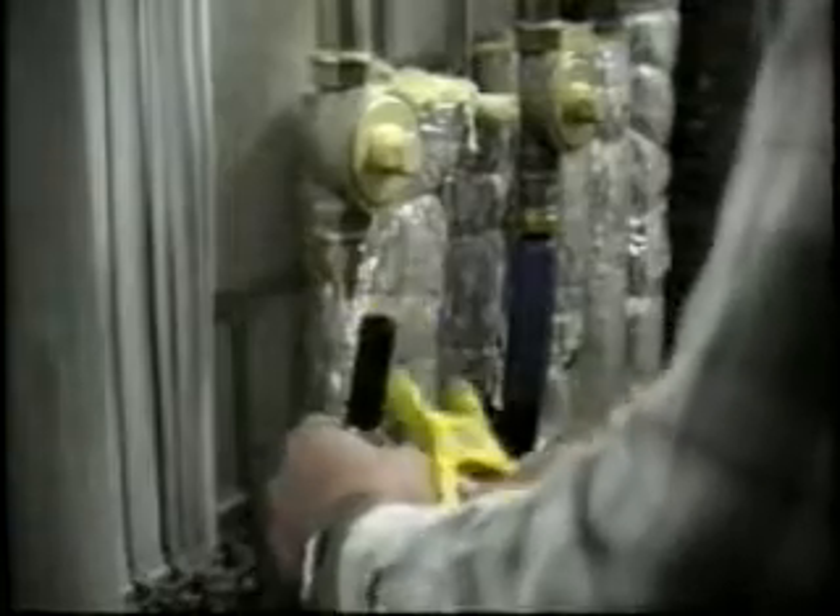The PEX-A pipe distributors are either mounted on walls, in airing cupboards, or in kitchen units. They are also used as the central supply points for all heat emitters — radiators or underfloor heating — in each of the apartments. Mounting varying dimensions of pipes is no problem because of the easily interchangeable compression fittings that can be used on the manifold.